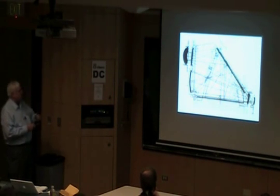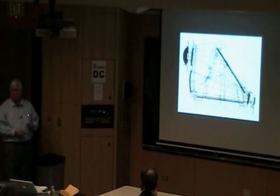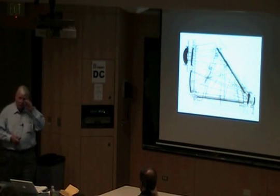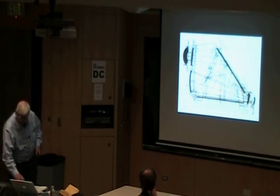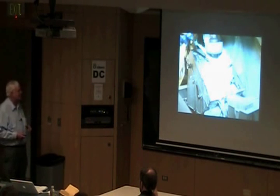Now, this is a little bit like the SX70, but different. There's no intermediate aperture stop. The image comes down here onto a focus screen, bounces off the mirror, comes over here to a concave mirror, comes out to the eye lens. Because we didn't have the aperture stop, it had a different geometry, we made the mirror a freeform. And one of the eye lens parts is a freeform. Worked pretty well. We got a very sharp view through that camera. Unfortunately, it had some other dumb things like a great big storage compartment for the pictures that made the camera bigger, for no apparent reason, because the pictures would easily fit in your pocket.